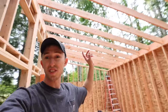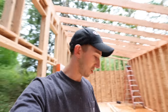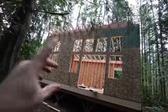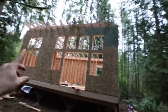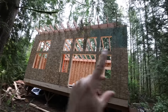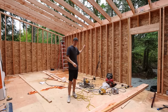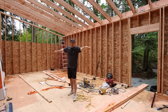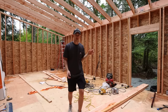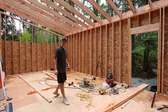Check it out — all of the trusses are set now. These were a total pain to set by myself because you have to hoist one end up on the other side. I'm going to copy this overhang and put that over here so the overhang looks uniform all the way around, except on the back side. All the main roofing trusses are on — we're going to bring some four-by-eight sheets of plywood in here so I can bring you guys upstairs without worrying about the tripod falling down through the trusses. The portions that overhang past the side of the home will make it a lot safer for me being up there.